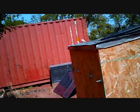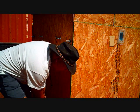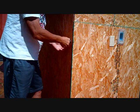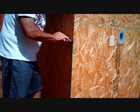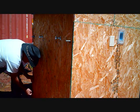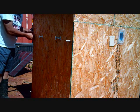To the well house, and what I'll be doing is taking this door off of the well house, which you've seen me do before. We have to get in there to turn the water on and unplug the heat lamp lights, because I put the heat lamp light on a direct plug-in, so that if it got really cold while I was gone, all we had to do was turn on this 220 and the heat lamp would come on, and the pump, obviously, but it wouldn't be pumping anywhere because no one's using any water, but that way it wouldn't freeze up. So that's why I did that. So the bulbs should be on in there. I know this is a process, but I don't have to do it very often.